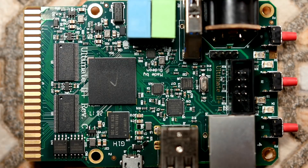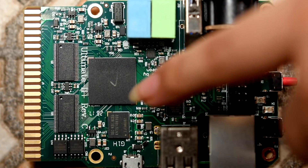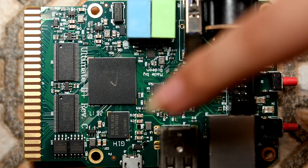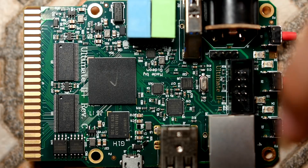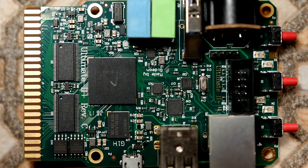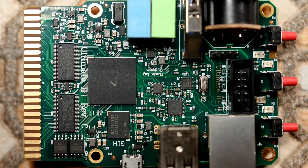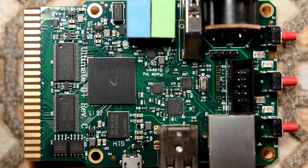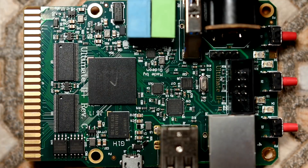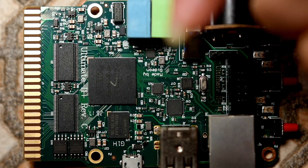Now this thing has a dual SID option. That does not mean it has two SIDs - it's simulating two SIDs. However, it's simulating one SID which can pair up with the one you have in your Commodore 64, and you can run them both together as a stereo or dual pseudo-stereo SID. I've already done the dual SID mod, so I can have three SIDs running in my Commodore 64, which I'll be going into in the next part. Because of course, I'm an audio geek, especially when it comes to SID or Paula.